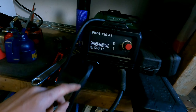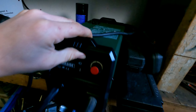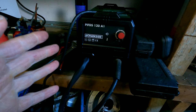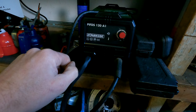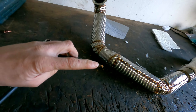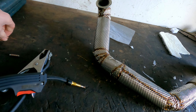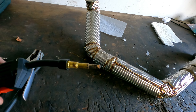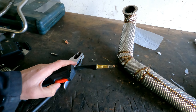There are no amperage markings on it, but I think it goes from 25 amps to 120 amps maximum. 25 amps is maybe a little bit high. This machine also doesn't have a tack function — on a more expensive machine you can put a timer on it to control how long it puts power through when you push the button. It's a little bit modified. I cannot put the power lower than 25 amps, but it will work if you just tack it quickly.